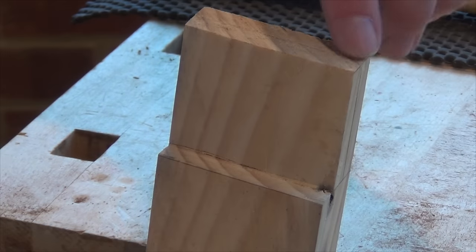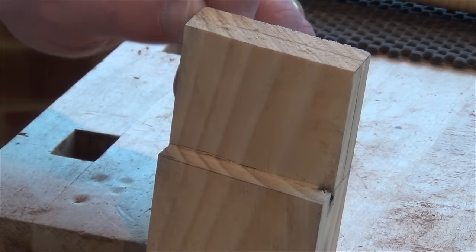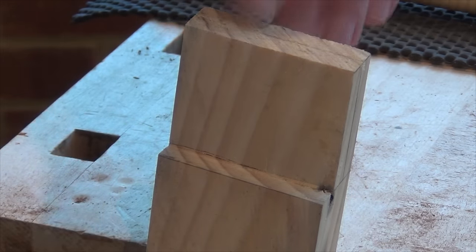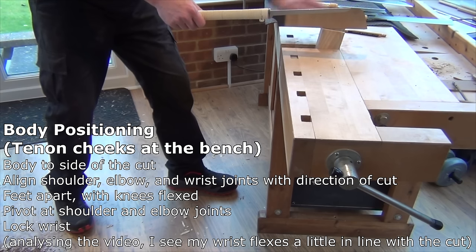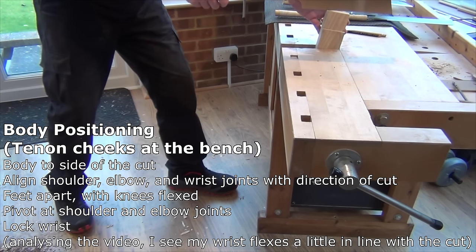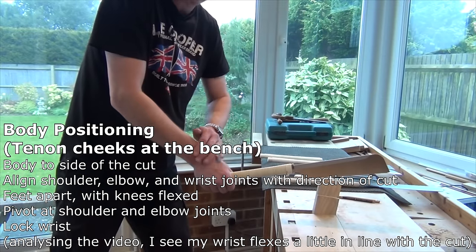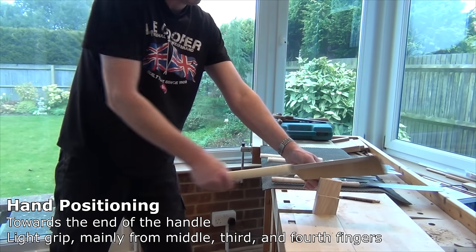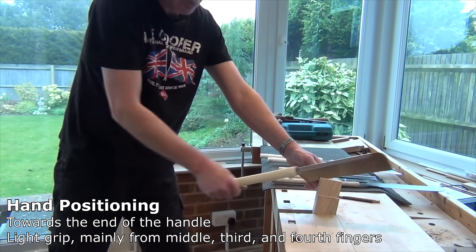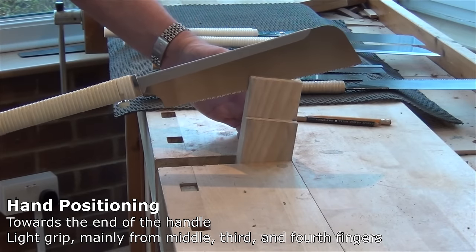I've sawn a little curve right the way across the top line. Now I'm going to track down the front line — I can see that nice and clearly — and keep the saw also in that top curve. My stance and position is pretty much the same as for western sawing, except I'm slightly further away from the work. I've got my feet spread out well, good balance in the legs, slightly flexed at the knees. As I saw, my forearm stays with the wrist straight; I flex at the elbow and at the shoulder. Once you've got the action right, you can speed up the cut — not by putting more pressure on, but just by going faster.